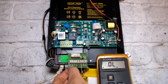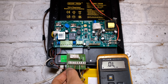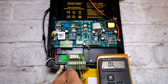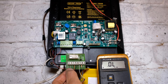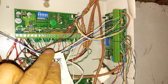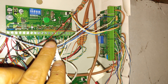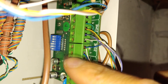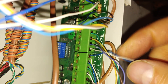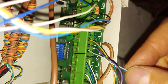That would be for the IDS alarm. Now I go and connect it onto the panel. I'll go and find a zone and put it across the terminals of that zone. These are just expander boards - yours might look a little bit different, yours might be the zones on the panel itself. As you can see here, I'm on the second zone. My electric fence wires are these two, the blue and the white, which I'm toggling now, and that happens to be zone two.